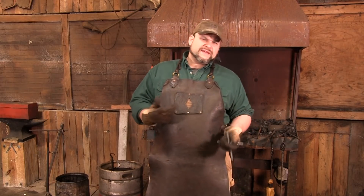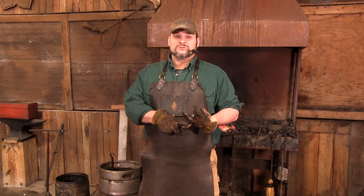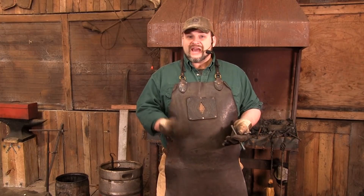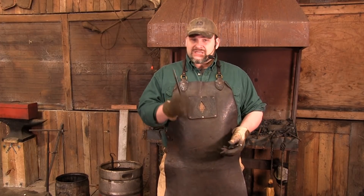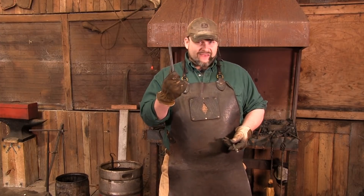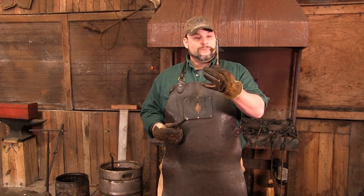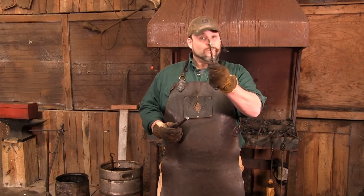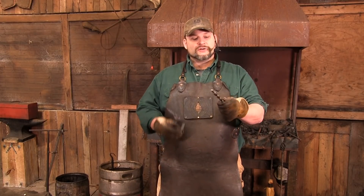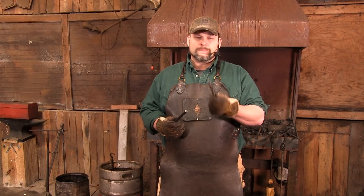One of the things I've been trying to do over the past couple videos is cover the bases between you guys doing it from scratch using everything the old way, to some of you who are starting out that actually have tools from the modern age. Today we're going to be using a modern electric welder and this piece of half-inch mild steel - same stuff we made the punch out of last time. But here I have a half-inch drill bit that's bent. Why is it bent? Because apprentices suck, that's why. However, I hung on to this piece because this particular drill bit and most metal cutting drill bits you'll encounter are made from a general group of steels known as high speed steels.